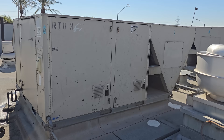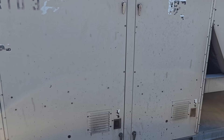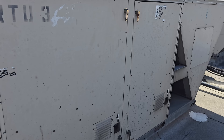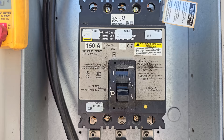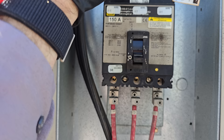This is an actual circuit breaker panel, so first thing I'm going to check — we're going to walk up to this unit, open it up, and it is turned off downstairs. I turned this off up here too. Now before we turn on the main breaker, we should open this panel and see if there's anything on the line voltage side of this safety switch. This looks like a breaker but it's not — it says 150 amps, but that's just the amount of current it can handle. It provides no overcurrent protection, so this is merely a safety switch.